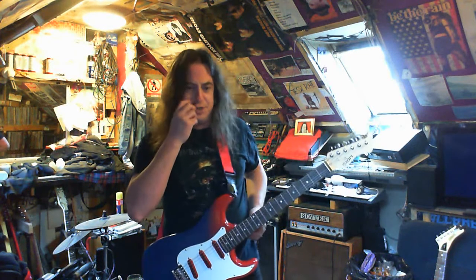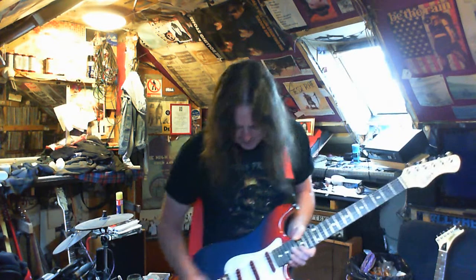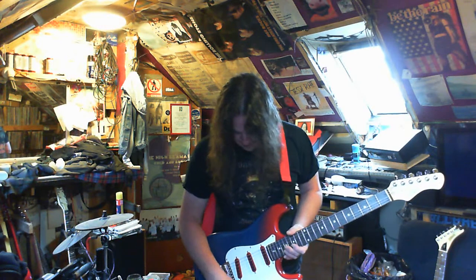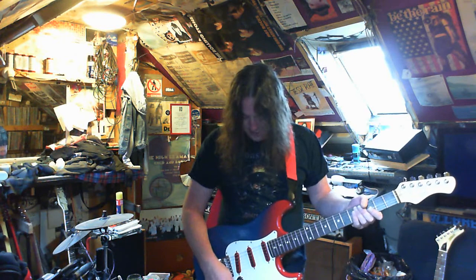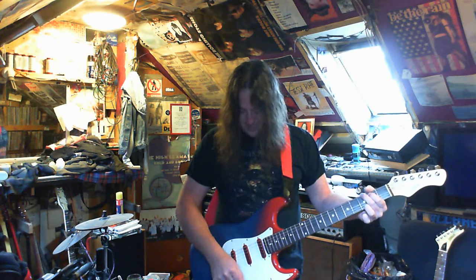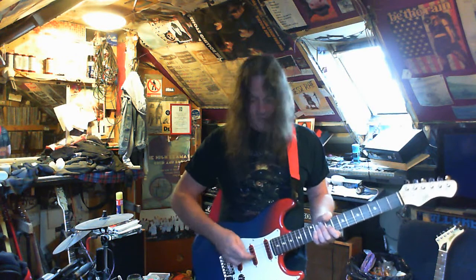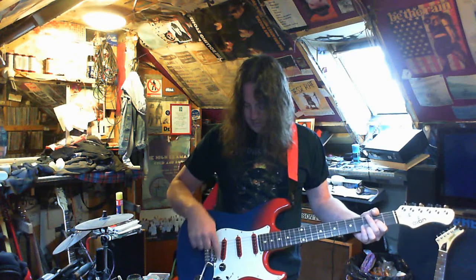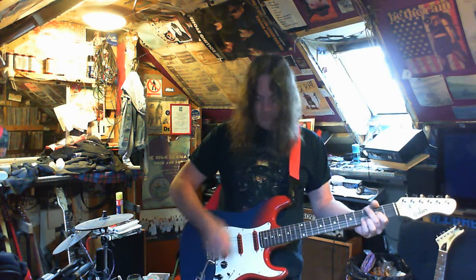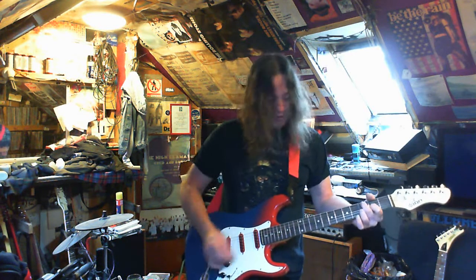This is the next generation of trying to find the ultimate way of wiring up a Strat. I'm not sure this one's quite there because there's a problem — well, it's not that much of a problem. If you're in Strat position you've got the five-way switch. If you're in the humbucker position, because of how I've routed that pickup through this one, the five-way switch has to be in a specific position. I think there might be a way of wiring around that later. Basically it just means that when you're in either humbucker mode you have to have the five-way switch in one of the middle positions — but it does give you a kill switch if you're playing humbuckers.